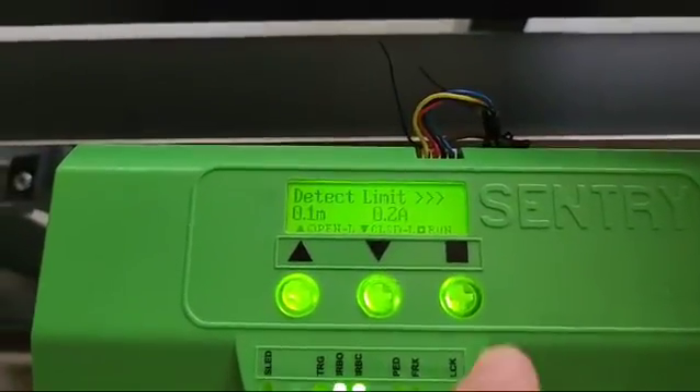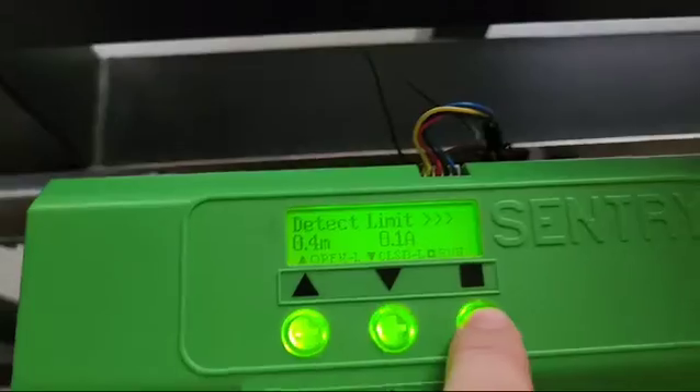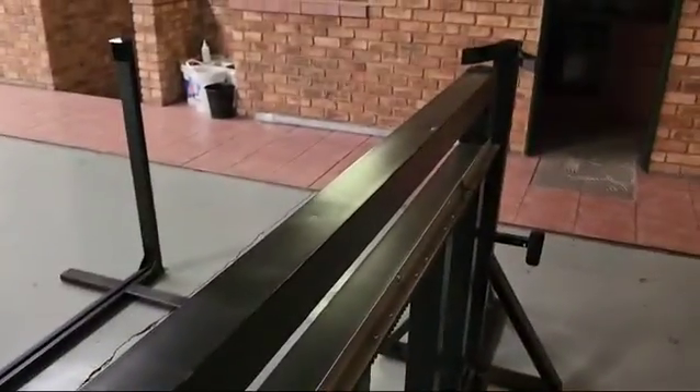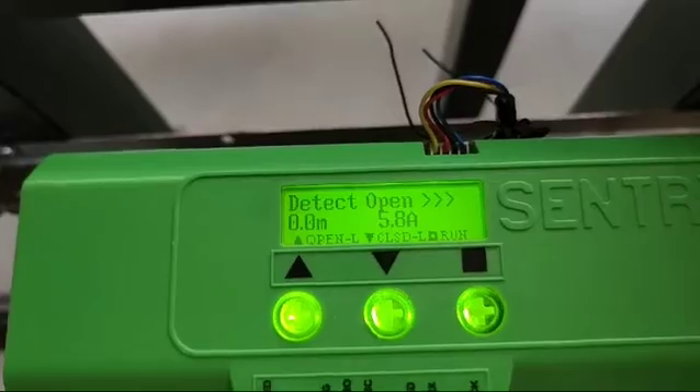This gives the gate a short bump along the rail just to let you know that it is in setup mode. You may now press and hold square to run the gate towards the end stop, or you may give a slight increment along to run the gate until you are happy that it has reached its end stop. Once it has reached the end stop, press down and it will log that limit into memory.